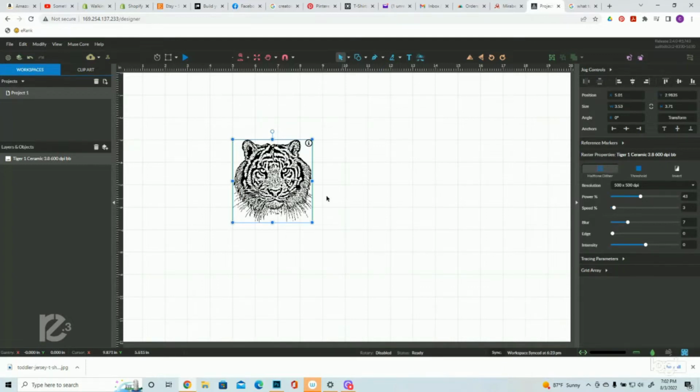The other thing to consider, and I'm sure I've mentioned this in a different part of the video, is making sure that your tiles are nice and fully covered with the spray paint. If there are any areas that have less, or don't have quite enough, the laser will burn it off and it'll fade out your image, so it won't actually react to the paint, which is what you're doing. You want that titanium oxide to react to the light and to permanently engrave a black onto the white tiles. So if you have too much power, you burn off all the paint, and if you have too little power, you don't give it enough chance to burn into it to create the reaction.